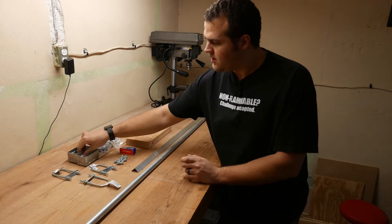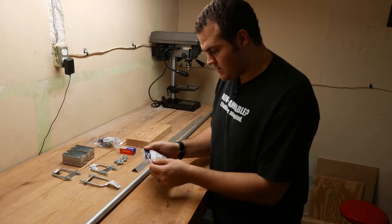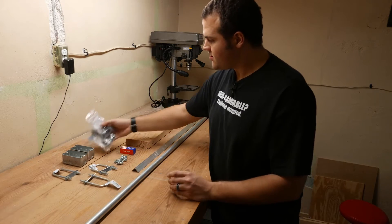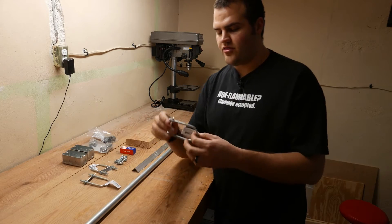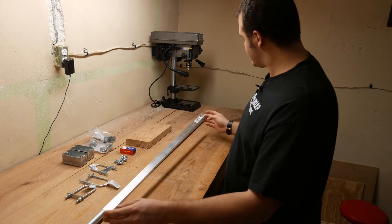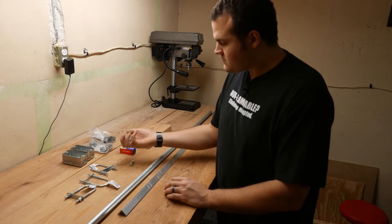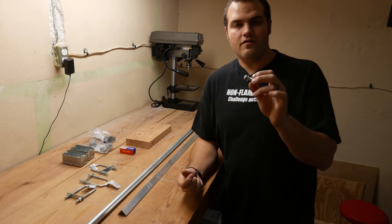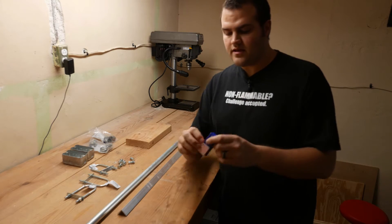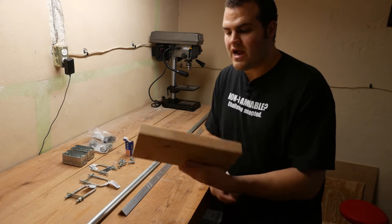Here's what you're going to need for this build. I got two little metal gang boxes and two packs of conduit connectors — six total, I only need four, but they only sold them in packs of three. I got three U-bolts, three-quarter inch conduit at five foot length, and a 36-inch length of one-inch L aluminum — I'm not going to need all of it. I have six one-inch long 5/16ths diameter bolts with nuts and lock washers, six total. The last things are ten 608ZZ bearings — basically skateboard bearings — and a scrap piece of 2x6 board.